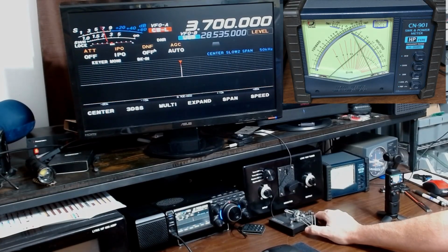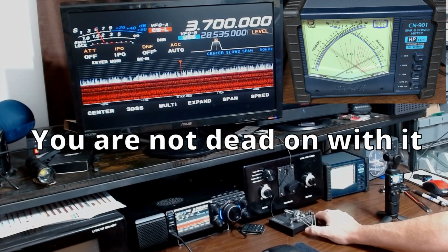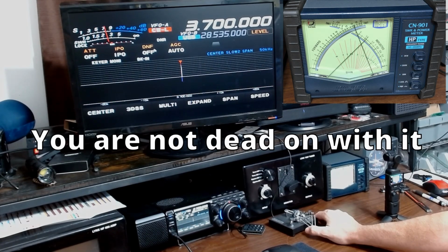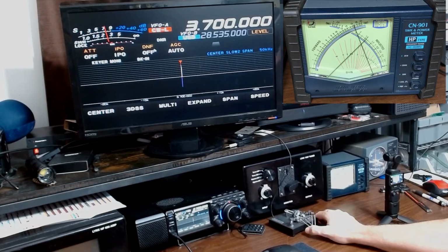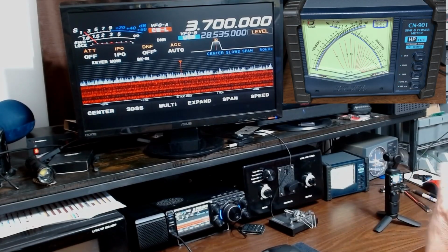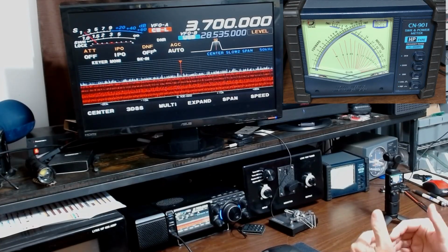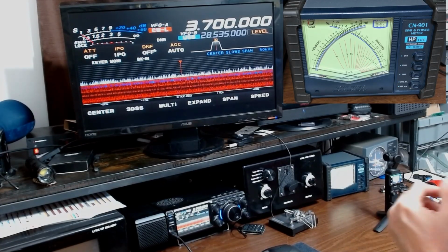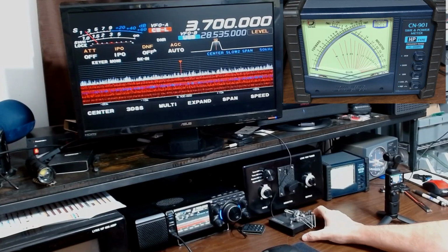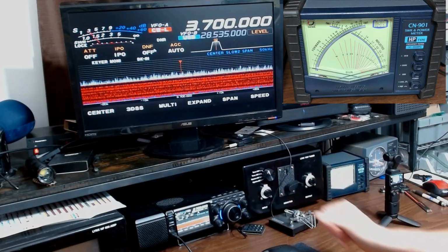How much wattage are we putting out? Well, about 16 watts. Reflected about 1.6 watts. That is the antenna tuner out of the loop. So I am definitely not resonant. My antenna is not precisely 50 ohms with 0J. So with that in mind, let's switch over and put the antenna tuner in line.